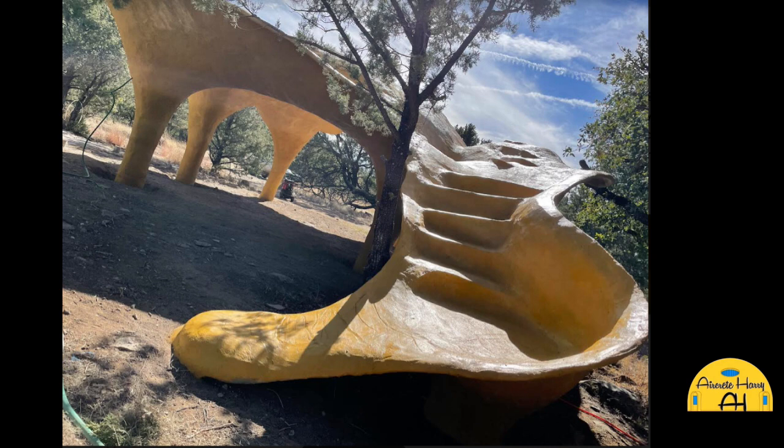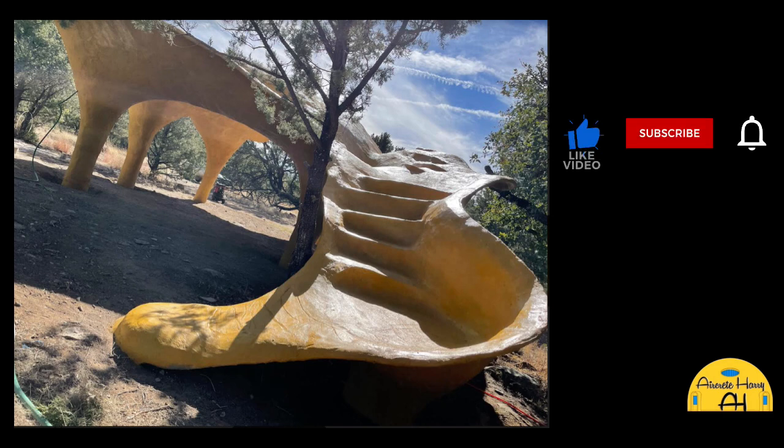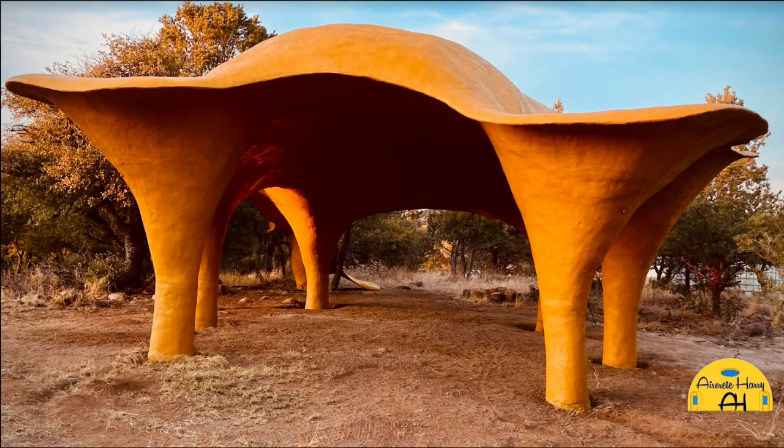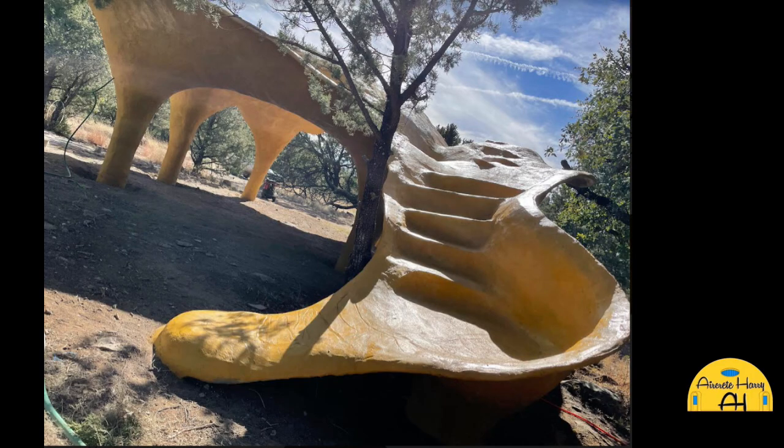Yeah, I mean, if you had a free pile of pumice that you can just shovel into the form, that would be fine. It doesn't have to be cohesive around that frame. It would be just as solid as if it were a concrete, because that stress skin and frame really contain it and give it the strength. But the fact that you can mix and pump cellular concrete with one person, and you can do like 6 or 7 yards an hour or more, makes it very inexpensive because of that labor saving effect. And so, yeah, I love that.